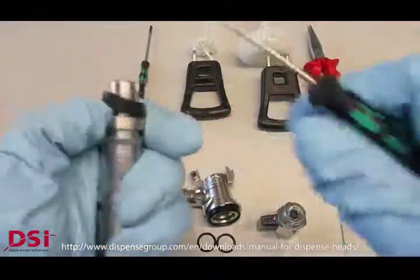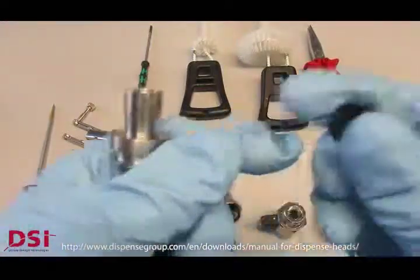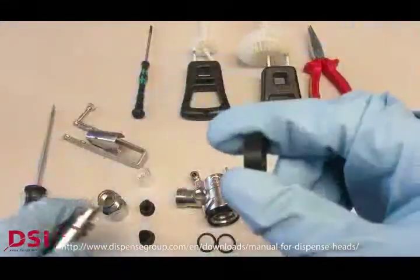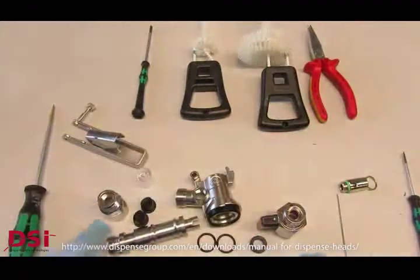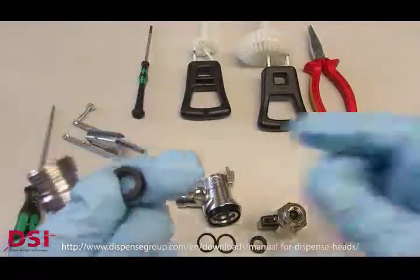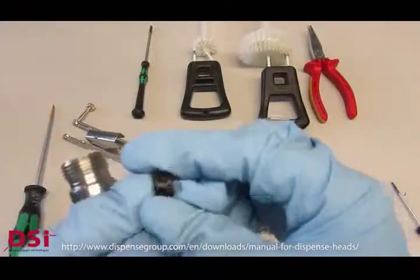Here we have the beer sealing. Just lift it a little bit up out of the seat of the probe, and then you can remove it with your fingers. Here, check as well if you have damages. Otherwise, you push CO2 gas into your beer side while tapping, and that can cause foam in your complete system. That's the sealing for the ball valve. It has a different size. That's for sure easy to detect.